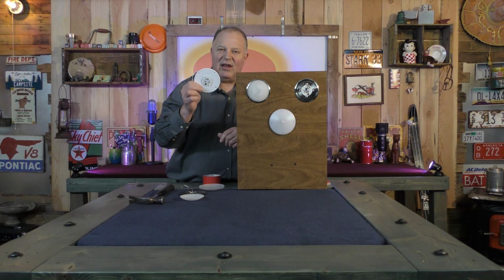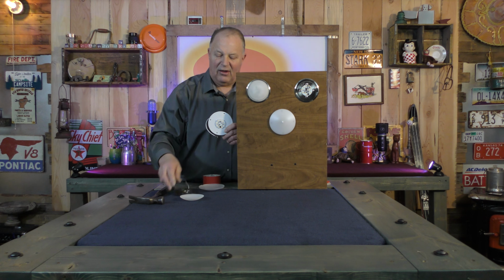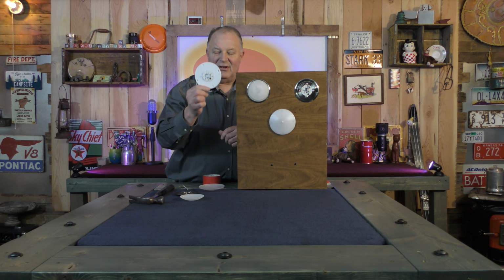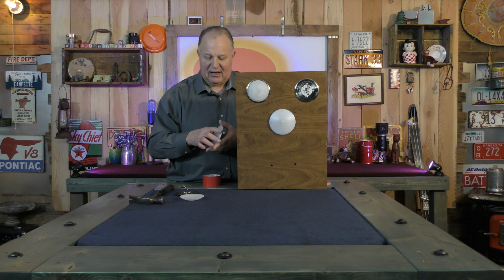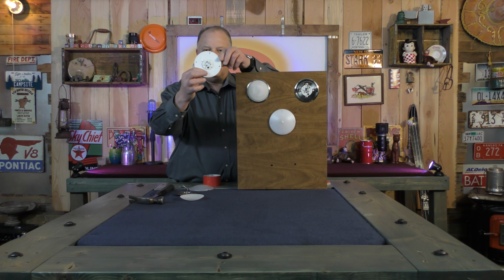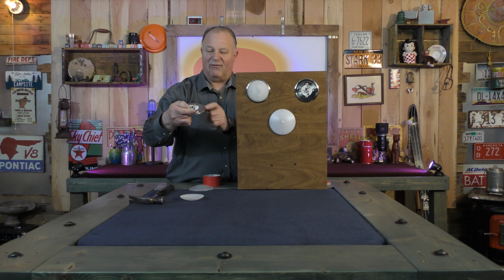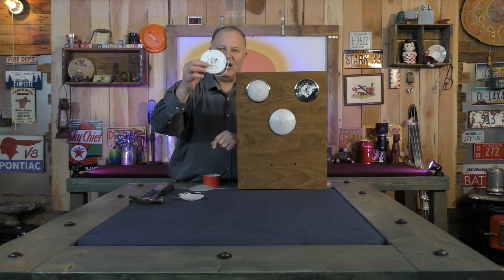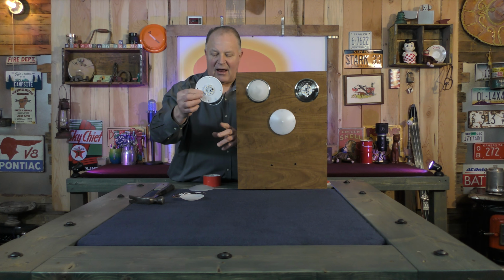So all these lights have their weak link, but these are less expensive than these. These are much harder to find, much harder to work with. If this fails, you throw it away, buy a new one. And these are easier to get. So the lens just snaps on. After you install it, you've got 4 screw holes around the face of it here. And yeah, they're not going to match up to this. These have 4 screw holes more in the center, but that's okay. You're replacing the light. It covers the holes in the ceiling. It's all that matters. Covering up that old footprint is what matters.